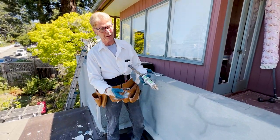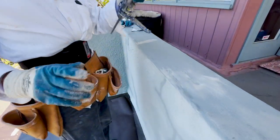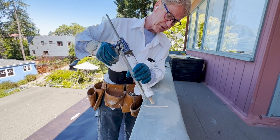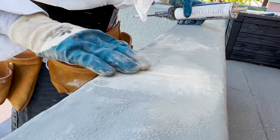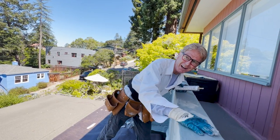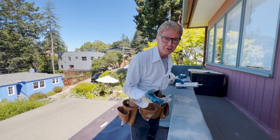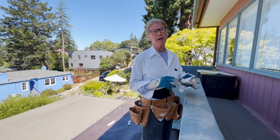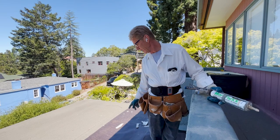There are a lot of types of caulking. You've got Morflex, which is basically rubber, and you've got Sikaflex, which is even stronger. Now if you have cracks — you see this crack right here — what we did is we took a wire brush and cleaned it out, because nothing adheres to a dusty surface. Not dust, dirt, moss — nothing adheres to it, not even the strongest caulking. So you get your caulking in that hole and push your hand down. This is the magic glove — just go over and over, get it in there deep. Then you paint that every five to ten years, or when it recracked, put some caulking in. Get an exterior caulking that says it will last at least 60 years, or get one with more flex. This stuff actually says it stretches like rubber, and it really does. Sikaflex is even stronger, but it's not water soluble — once you get it on you, it's on you forever.